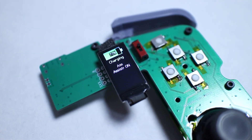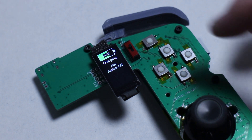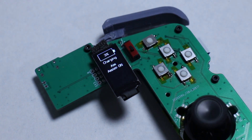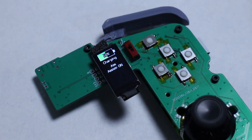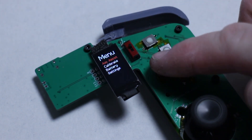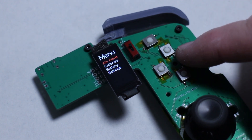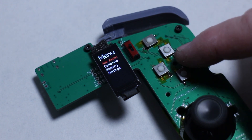The mode toggle switch simply switches between gamepad and keyboard mode, as some games don't have very good controller support. I'd like to have keyboard mapping for the controller fully customisable from the LCD display along with macro support, but that will have to wait until the core functionality is done before I'll know if there's enough memory left on the controller to achieve that. A press of the menu button opens the controller's inbuilt menu and disables all of the controls from interfering with the system.